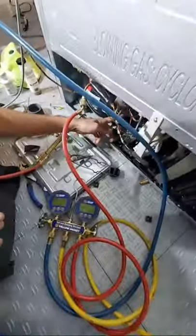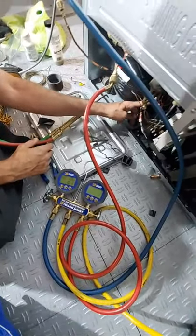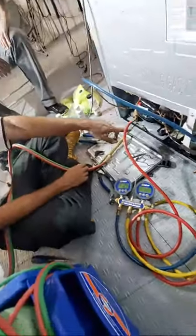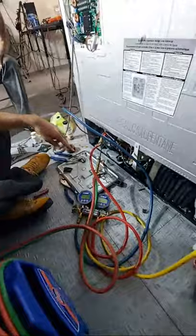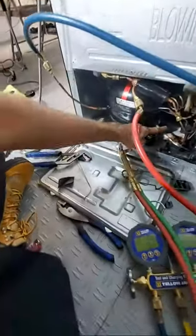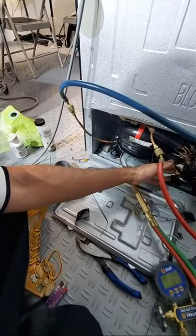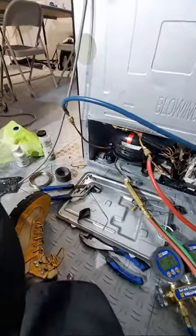Let's go ahead, get a spotlight down here, and locate the leak. That's your assignment. When you locate it, let's see if we can throw a little bit of solder on there. We can salvage this compressor. But you're good to go here. Anybody got any questions about what was done? Did it make sense? I basically took a larger diameter and placed it over two as a union coupler. That's it. Any questions? Preparation.